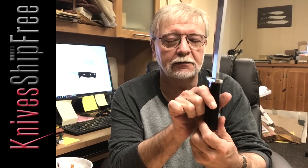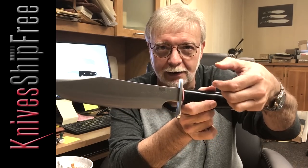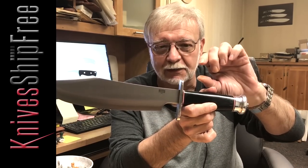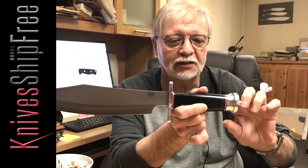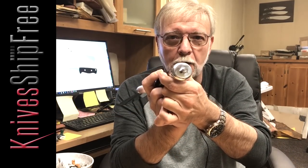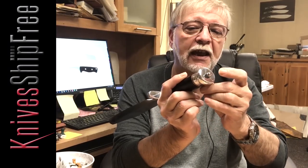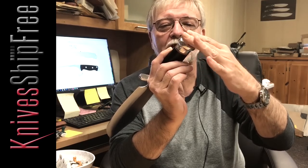It is a through tang, and the tang is about that wide — it's not a rat tail tang. It goes all the way back and steps down. If you notice on the back, we used a through acorn nut, which means the tang sticks right out the back, and then we cut off the excess and blend it.